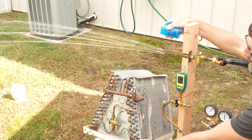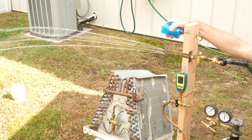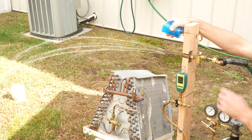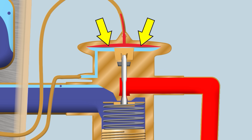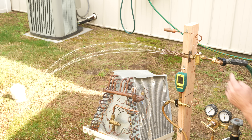It could be lower-temperature air, or less air — less of a heat load crossing the coil. You're going to see the volume of water traveling through lessen and lessen. This bulb is the opening force for the thermostatic expansion valve, and if it senses a low temperature it's going to allow less liquid through.